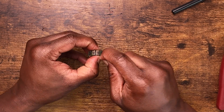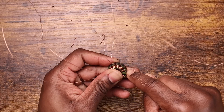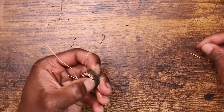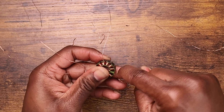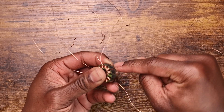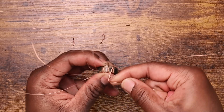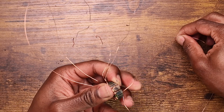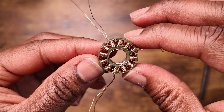Now you're ready to rewind everything, and this is the complicated part. It's very difficult to make sure every turn around each stator tooth is perfect. Ideally you don't want the wire overlapping much unless you absolutely have to. Make sure you follow the color coding on the wiring diagram. You're going to need a lot of wire, so cut a very long piece and trim the excess later — you'll need a long piece to represent each color in the diagram. Once it's all wired up, you should have something that looks like this.